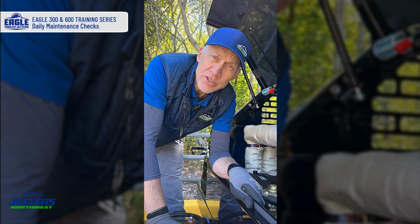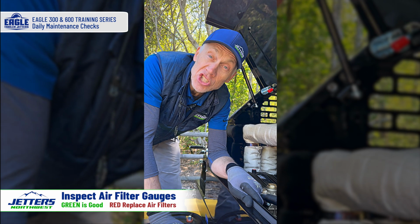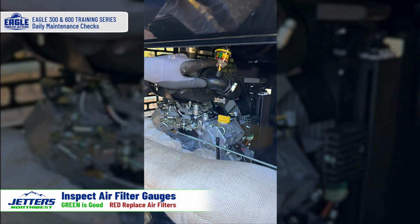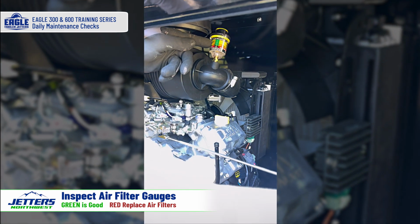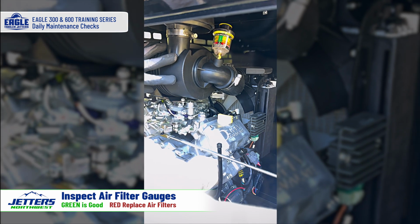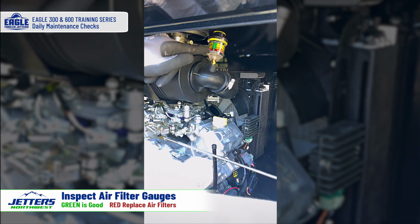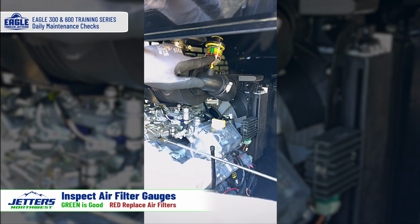Okay, last thing we're going to do is check the air filters and the antifreeze level in our engines. So as we work toward the back here, I have an air filter gauge. When this is running, if it's sitting up here, this yellow diaphragm, if it's in the green, our air filters are good. As the air filters, which are behind here, start to get fouled, when it's running, it's going to pull that yellow diaphragm down. When it gets into the red, time to change your air filter.